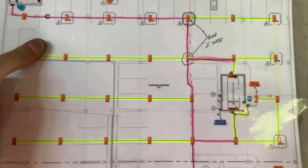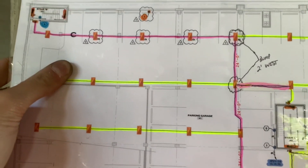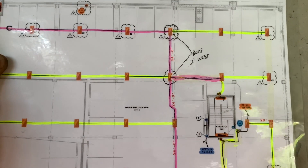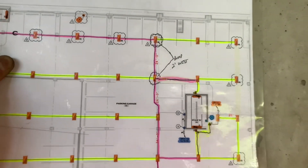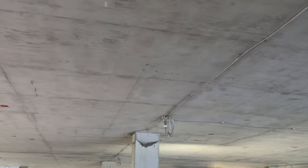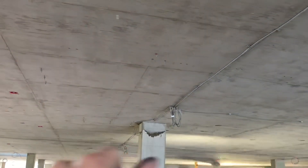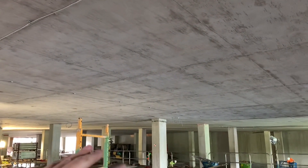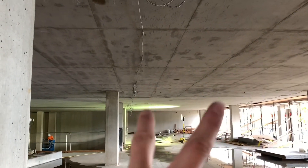That's just an example of how the blueprints work in real life — basic lights and exit signs, emergency 12-3 and regular 12-2. Yesterday I only had this one row going all the way down, but today I basically finished the whole floor except for over the ramp coming up from the parking garage — both of these rows done all the way down.